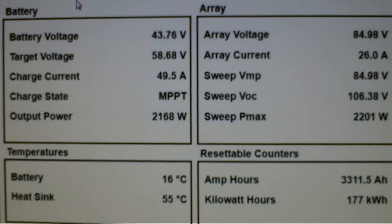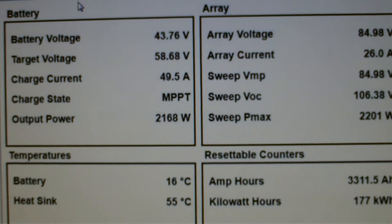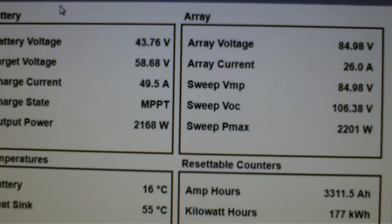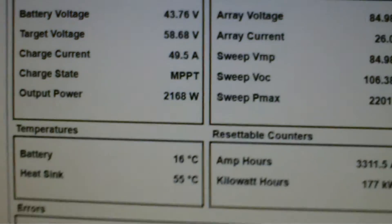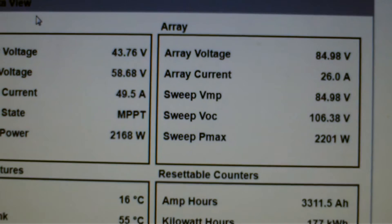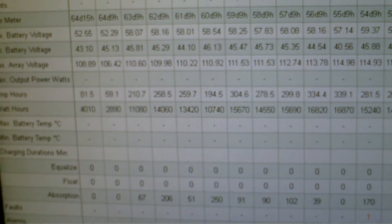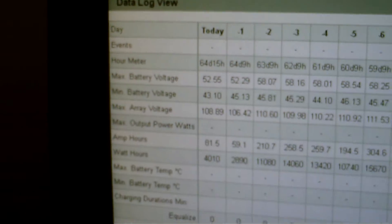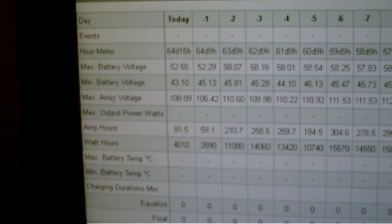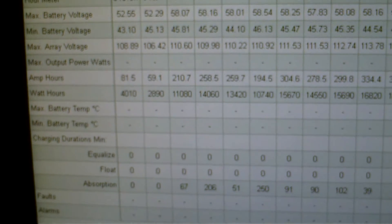Here's a screenshot from the other day showing you what the system can do at about 2 o'clock in the afternoon. It was a little bit overcast that day, but not quite as bad as today. You can see that on that day it had well over 2,100 watts, and the charging current was 49.5 amps. I'm expecting that in the summer, with the sun straight overhead, I'm going to be able to produce close to that 60-amp charging — no problem. Here's the historical data — you click on that link and get this data log. It shows you over a span of about 200 days. It records your maximum and minimum battery voltages, array voltages, and amp hours for the day, so you can see what kind of power you're producing.